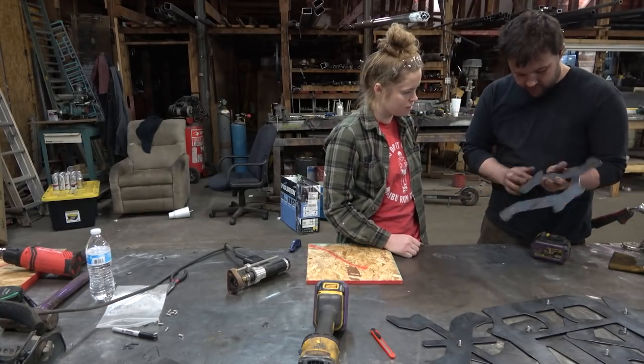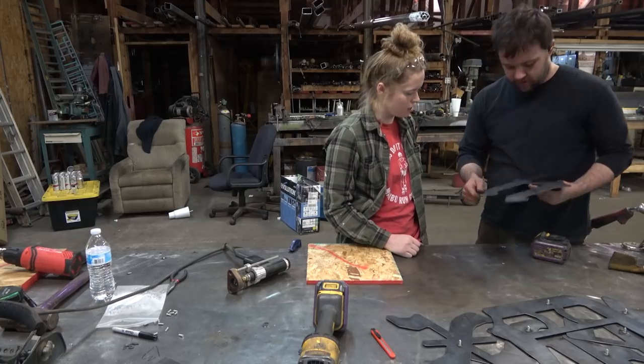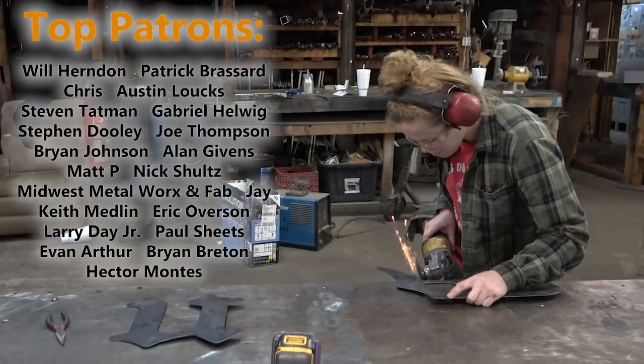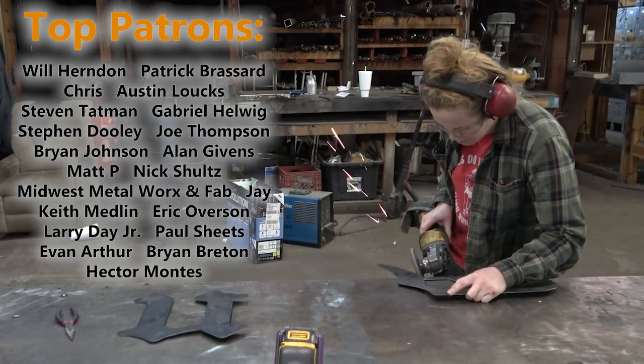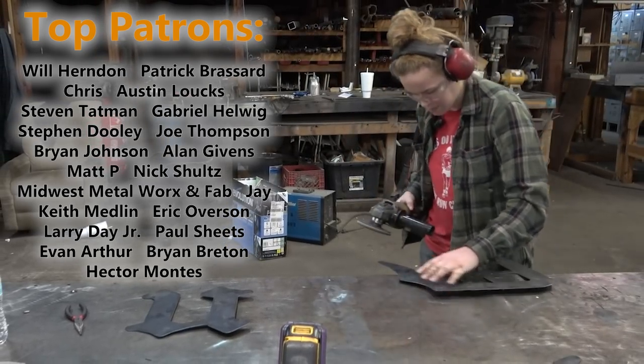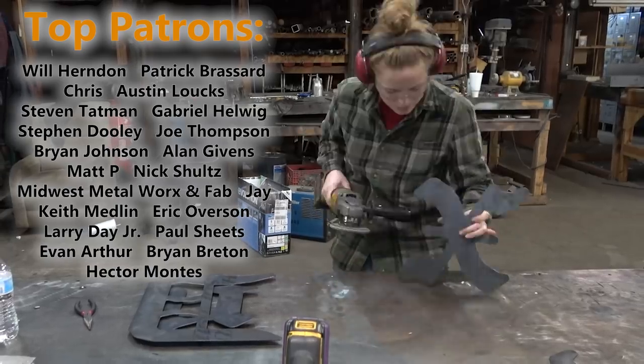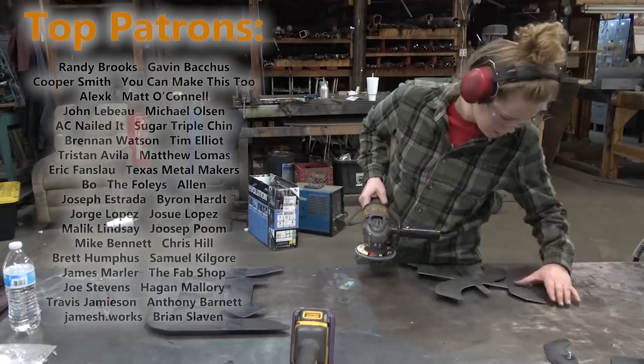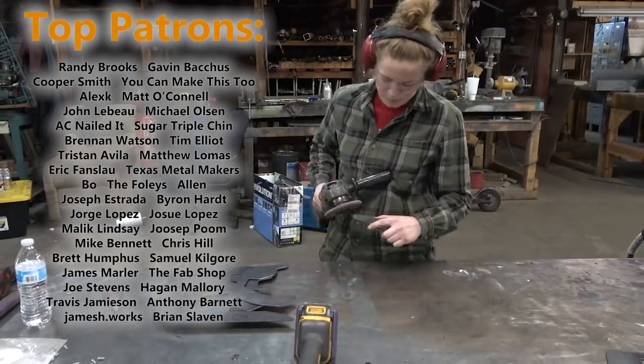So I figured I'd just let most of that run out in real time so you guys can see, a stud welder is just a time saver, is really what it's about. A nice side benefit is that on 14 gauge and above, there's no mark or scar or heat distortion on the face of the plate. So that's a nice benefit not to have to do any finish work there.